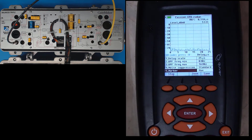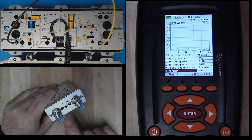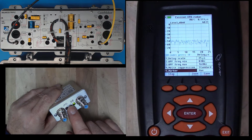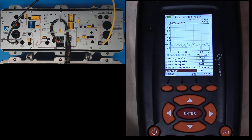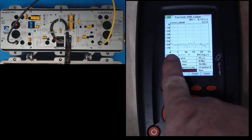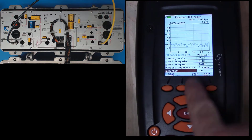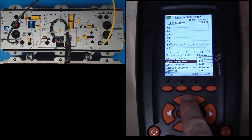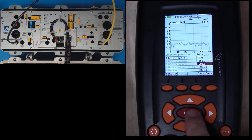I'm going to turn my amplifier on — right now it's off. Press and hold, make sure that it is 20 dB, and it is. I don't see any CPD. That's strange because the reports I've been getting indicate I have something on this leg. Right now my span is from 0 to 25 microseconds. Let's expand that span to 50 microseconds.